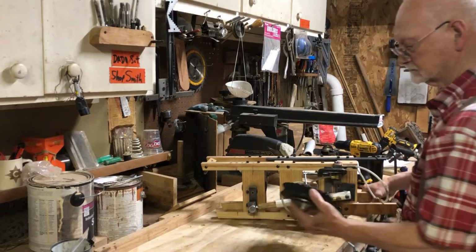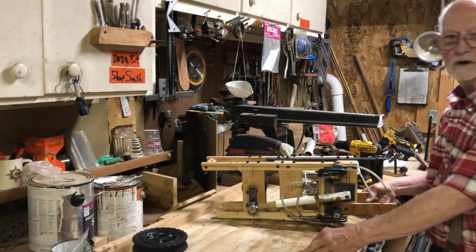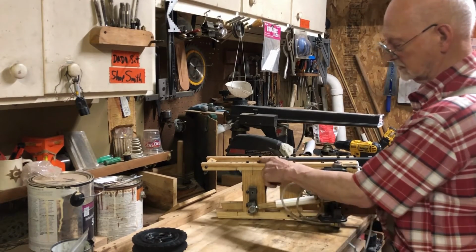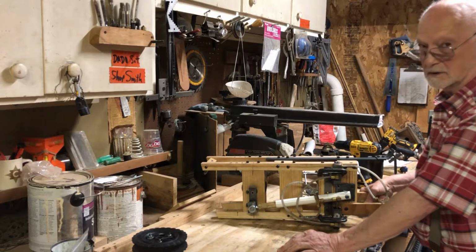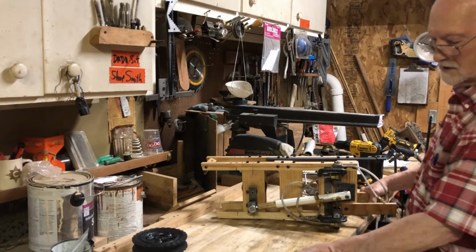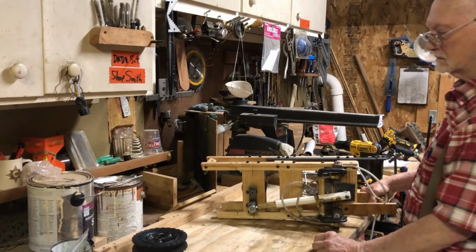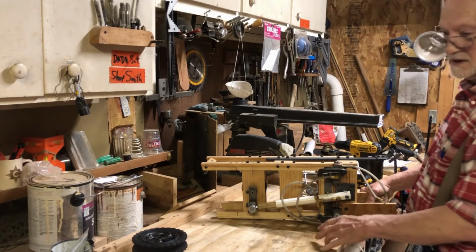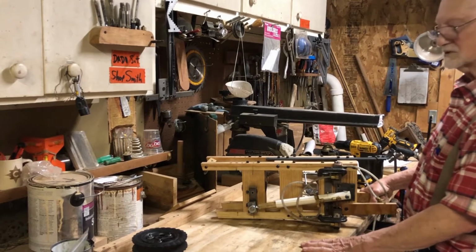And one other thing that I had done, I went from this 6-inch wheel, which was giving me like a 4-to-1 ratio, 4 times with this wheel to 1 time the bicycle, to a 3-inch wheel. So that's going to give me roughly a 10-to-1 ratio, which I'm hoping will give me plenty of oomph when I need it. And a higher gear ratio is okay. It will use more air, but this is not meant to be driven all the time. It's only what I call a compressed air bicycle assist. So if you're going up a hill, it gets kind of hard on you, then you can activate it and take a little pressure off of your pedaling.